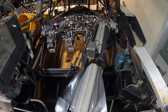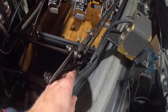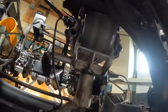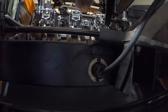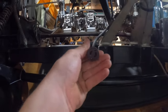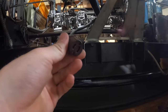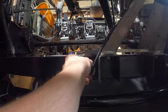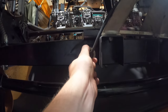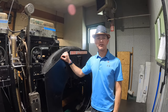You may wonder how the pin counter gets power. There is a wire that comes out of the side, goes down and is zip tied to the side of the distributor, and runs down under the distributor to the yoke. There's actually an outlet in the frame of the machine that the pin counter plugs into — here's what the plug looks like and what the outlet looks like. A common problem with pin counters is the plugs falling out. To prevent that, when you plug the pin counter wire into the outlet, push in and then twist to the right — that locks the plug into the frame so it does not come unplugged while people are bowling and prevent the machine from cycling. That concludes our overview of the pin counting device on the AMF 8230 pin spotter.